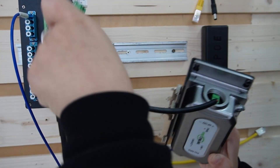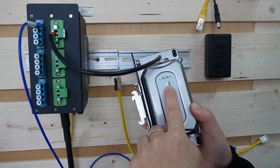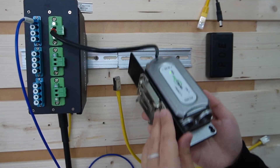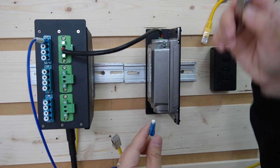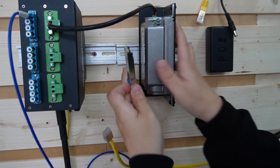Let's plug it into the power supply here. Now you can see the indicator is on — it's getting power and data. The data is coming from our fiber patch cord. And we need the SFP transceiver — let's plug it in here.